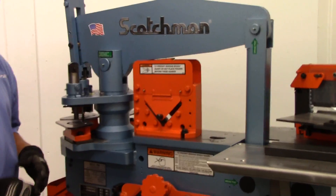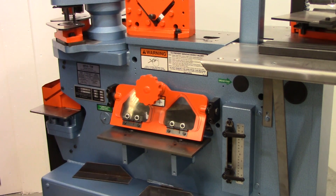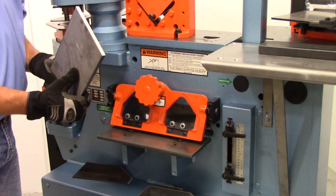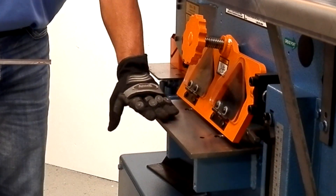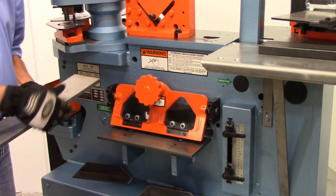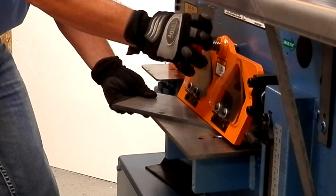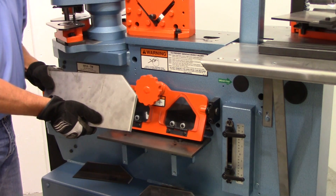Down to our flat bar shear — we have a 14 inch flat bar shear, which is good for three-quarter by four out to quarter by 14, and three-eighths by six plate. It cuts with no problem. Keep in mind you can get an optional shearing table with a squaring arm and jigs for 45 left and 45 right. We also have back gauges for these machines if you're making a bunch of the same plates that need to be the same length — push right up to the back gauge. You can also lock it down at any degree you want and make your gusset brackets that way.